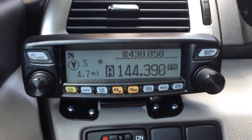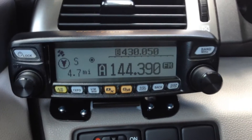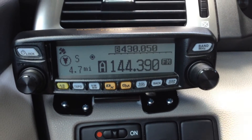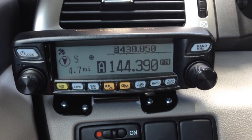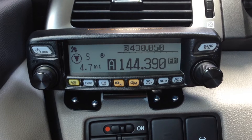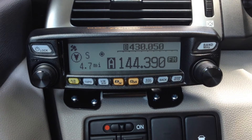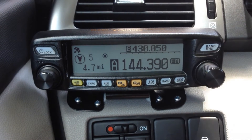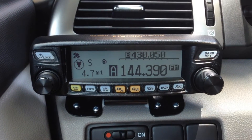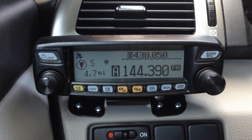This is the FTM 100. We're in APRS automatic mode. I just thought I would show some of the APRS traffic here in San Antonio, since the perception is there's not much. I've been messing with the mini system for a long time trying to get it set up, and there's been quite a bit of traffic — Kerrville coming through and Ingram, and a couple of mobile stations beaconing. It should be beaconing out here shortly; I've got it set at a 30-second interval for this short test.